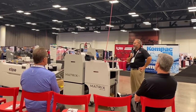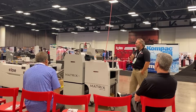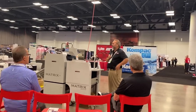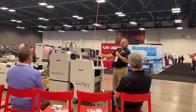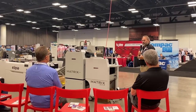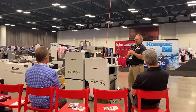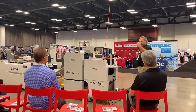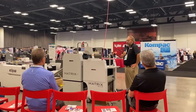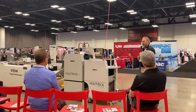Sleeking has been around for 30-plus years. It originally was out there as more of a hobby and craft type market. As digital printing progressed and became more of a standard, technology advanced with the machinery and the foils, and it's actually become an acceptable commercial production method for cold foil. Our consistency has gotten a lot better over the years and the speed has improved. Foil manufacturers have started paying attention to it and actually making foils specifically for a cold foil application.